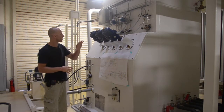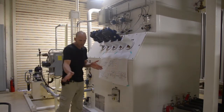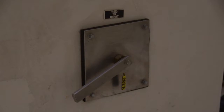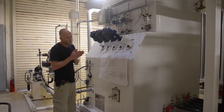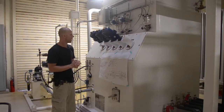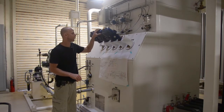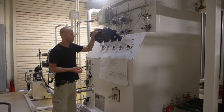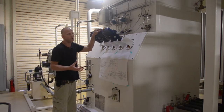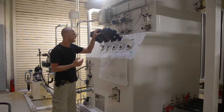Okay. So that whole process is controlled by the valves on the cold box face. On our turbine leg, on our liquefaction leg, we have V530, which is the main turbine valve. We need to open that in order to open that leg in order to spin the turbine. It's a manual valve. On the process air split that leads to the actual column, the high pressure leg, we have PCV 511, pressure control valve 511, which is an automatic control valve which will control the pressure of the bottom column. In doing so, it controls the flow of air to the bottom column. And this is automatically controlled according to a set point in our PLC.